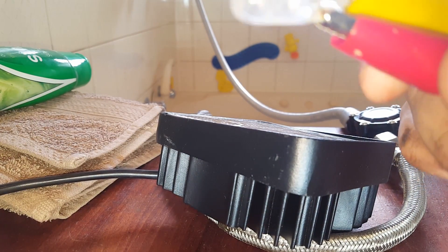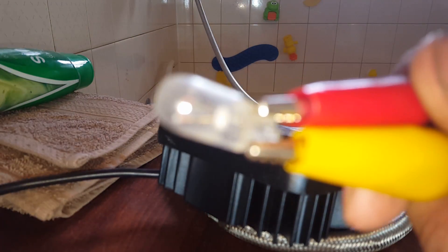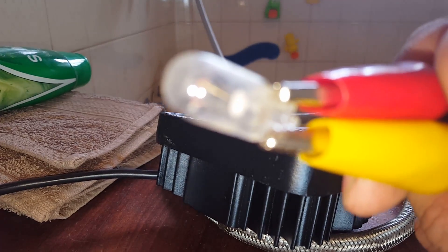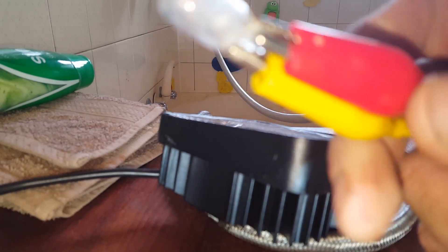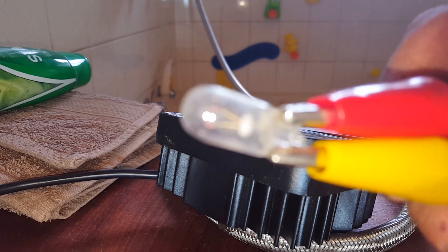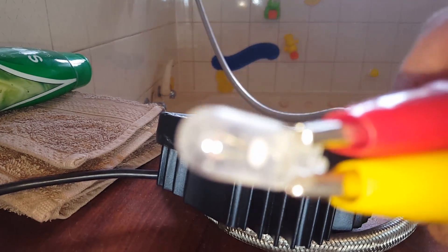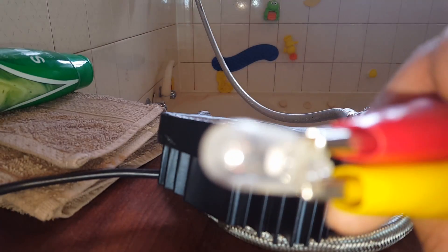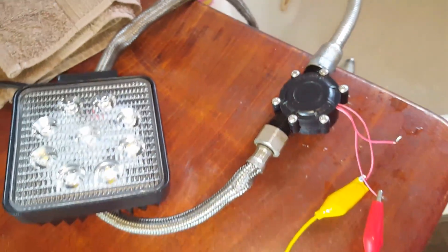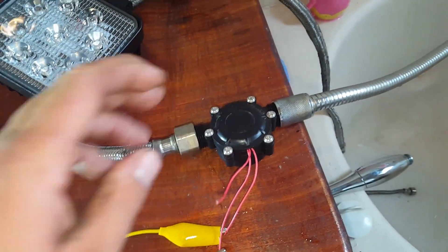There you go — a little mini hydro does work. They make a five-volt one which should have a reasonable amount of current behind it. I think I only paid six or eight dollars for this just for interest's sake. What we'll do is set up a little mini bridge rectifier and see if we can connect it inline with something — maybe a garden tap — and see if with a bridge rectifier we can charge a 12-volt car battery. Thanks for watching guys, catch you on the next one.